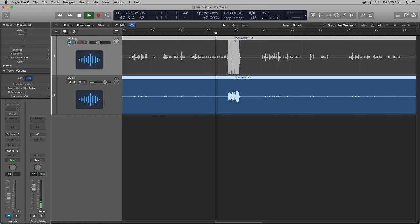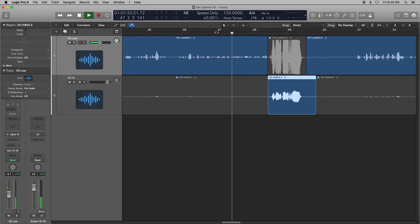Channel two was set up to handle those high dynamics. Muting the low channel and switching to the VO-high channel handles those peaks perfectly — not ruined. Then you cut them together: normal dialogue from channel one, the loud peaks from channel two, and you get a smooth clean recording. If you're doing any voiceover with a lot of dynamics, splitting your signal into two gain-staged channels is super important, and a mic splitter makes it simple.